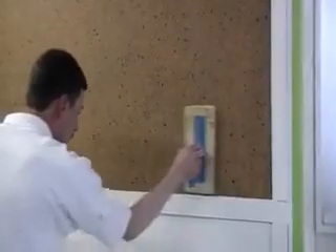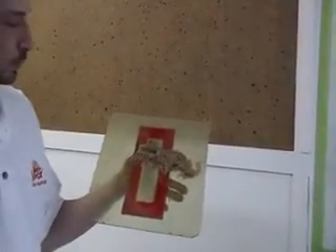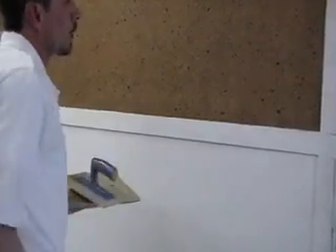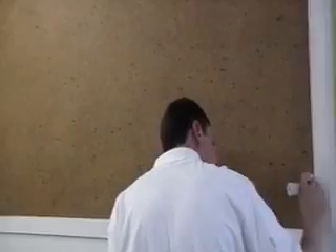To create repair material, take five to ten square feet of leftover material from the last batch and trowel it onto a plastic table, a scrap piece of smooth formica, or even a thick piece of plastic drop cloth or garbage bag. At the same thickness, let it dry, cut it with a razor knife, and scrape the pieces off and put them in a gallon ziplock bag for the customer for future repairs.